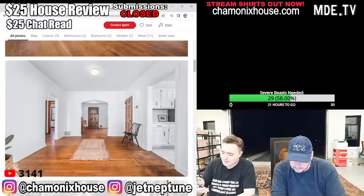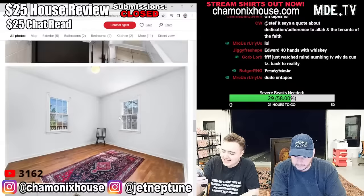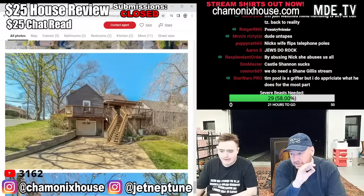Insulation in a barn? Spray closed cell at 2 inches in the walls, 5.5 inches open cell foam in the roof deck. It's expensive, but you don't have to deal with it again. Rock wool is great, but it's difficult to work with, though doable for DIY. I don't think it's that hard to work with, truth be told. That closed cell price I got was so insane, I couldn't believe it. I almost dry heaved when I got my closed cell prices.